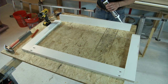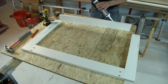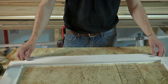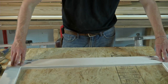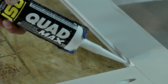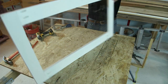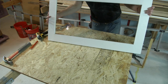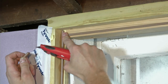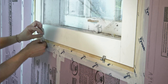For the storm window, I set a piece of plexiglass into a frame made from kerfed PVC in order to create a custom sash. The kerf is preloaded with sealant, then with the plexiglass in place, the sash boards are fastened together with pocket screws, and the perimeter of the window gets one more round of sealant for good measure. The finished window is set into place against the weather-stripped window stops and held in place with storm door hardware.